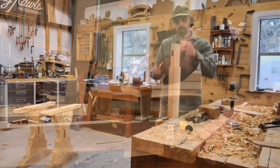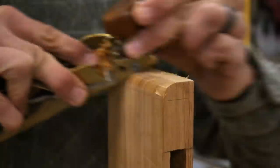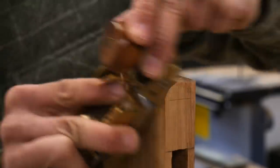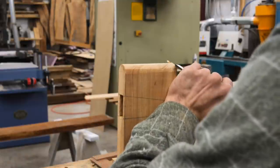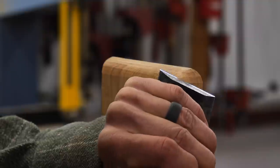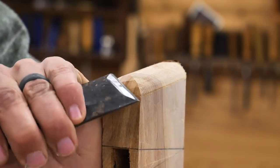Once I got the mortises cut in each end, I'm going to shape the end of that tenon — basically just make a round over on all four edges using that same skew plane, which is really effective at end grain because it's got that skewed blade and it's low angle, so it cuts real nice. I'm going to leave the tool marks in this and just kind of let it be as natural as possible. I'll do those two long edges and then the two ends I can just hit with a chisel, kind of hand shape a round over there. I actually have a video on restoring this wide blade chisel — I love wide blade chisels, they're super good at doing this carving type work, chamfering and things like that on end grain.